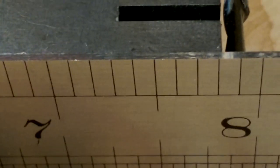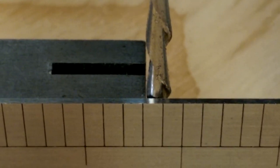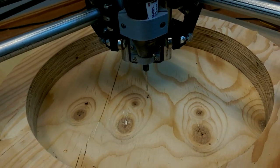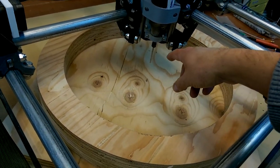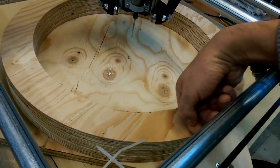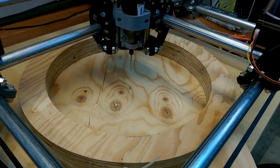I think it went just slightly too far. I'm happy with that - it's probably less than half a mil, so 500 microns by hand. So the best of my hand fitting - I've gotten the center of the tip of this tool centered within these two concentric circles, with the tip resting on the plane defined by the top surface of the work. That is where the origin is on the model. Now let's just start up the mill and see what we've got. Let's go.